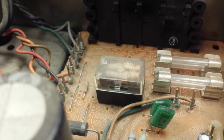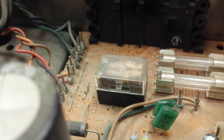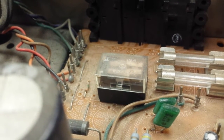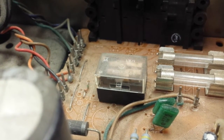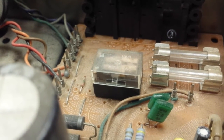However, it has one design flaw: a really cheap, low-current protection relay that we have to replace before we send it off. These style relays don't have enough latching force, so it's very common that they have issues, causing channels to drop out at low volume and a variety of other distortion and noise artifacts. We're going to replace that with a modern high-current relay.